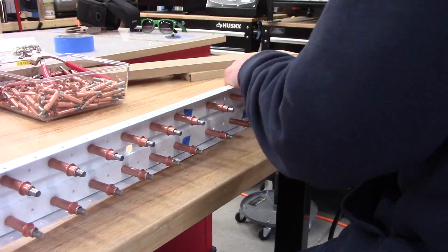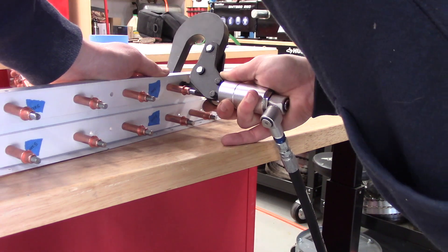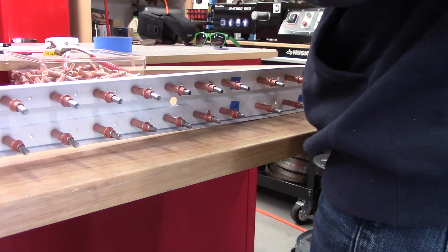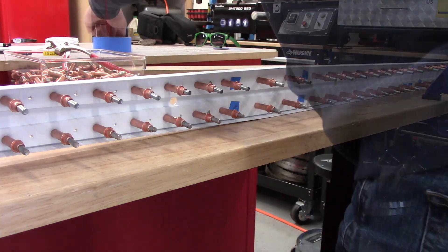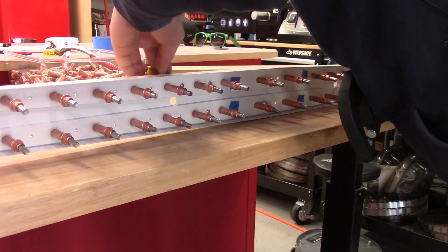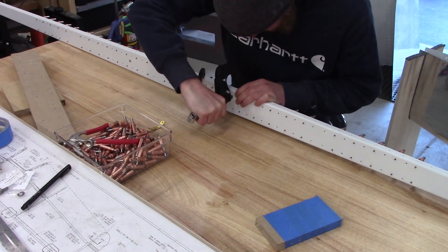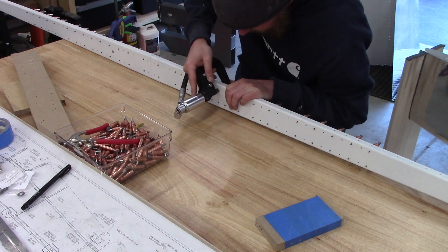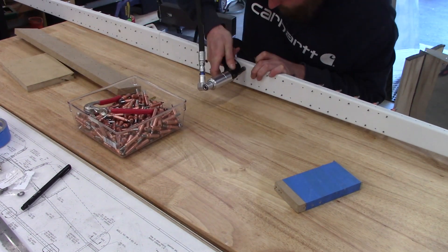The riveting process for the rear spar assembly is much like that for the vertical stabilizer rear spar assembly — just takes a little bit longer due to the sheer number of rivets that you have to squeeze. There are a few extra holes you've got to dance around; I marked those out ahead of time using blue painters tape, which came in handy later for knowing exactly which holes were for the hinges and which were for the ribs.